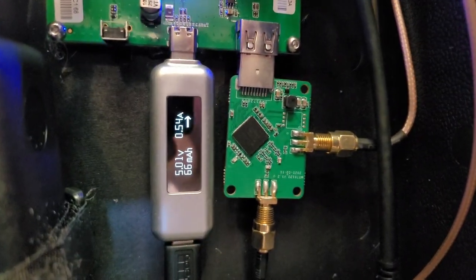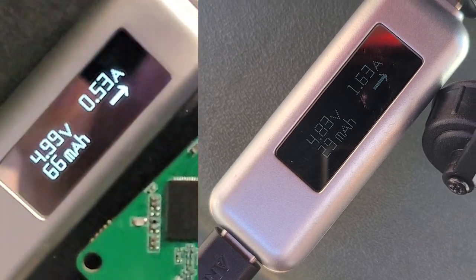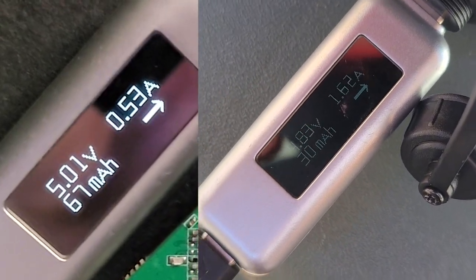And this is still plenty of power, because our Pineapple is only using about 2.5 to 3 watts with the radios active, as you can see here. If you're not too familiar with electricity and things like Ohm's Law and Watt's Law, how I calculated the wattage is just voltage times current. A lot of power meters will do this for you. I'm using the Sytechi USB power meter — it only shows voltage, current, and milliamp hours used. I like working in watts, because the voltage from the solar panel and from the battery are different, so amperage can't be held one-to-one. By converting everything into watts, we know the ~8 watts from the solar panel is more than the 2.5 to 3 watts we're using.